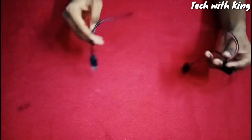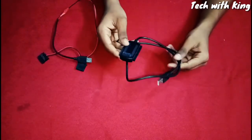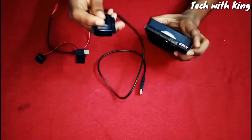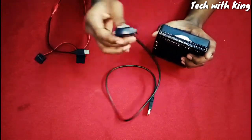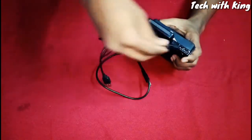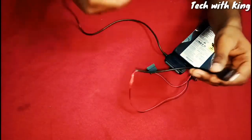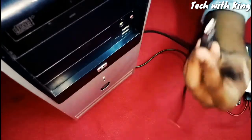After taping the wires, the power cable is ready. Next we need the IDE data cable — the link is in the description, you can check and buy it. This is the IDE port on the hard disk. We connect the IDE data cable here and we can use this with a laptop or PC.